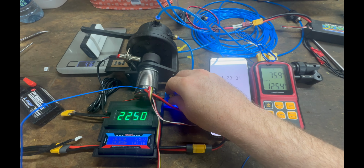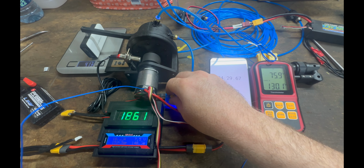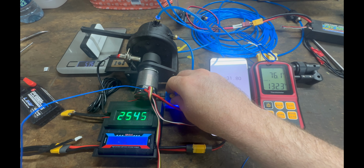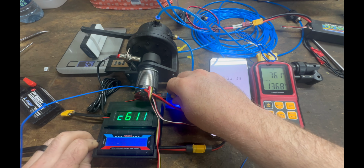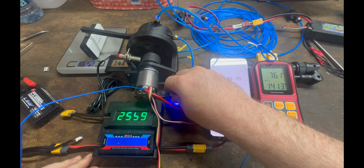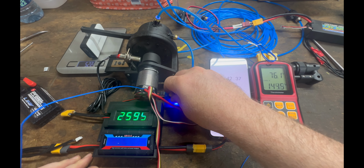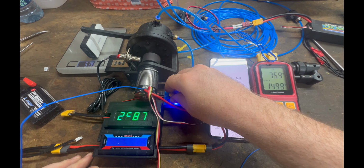Of the motor, and it's again throttling itself almost to zero. We have to turn it almost all the way up to get the 2200 RPM mark, and at this point the motor is just overheated. This is an interesting run because typically we would get the full 5 minutes out of a drone ESC and outrunner combination before we reach the mark of having to turn it down.